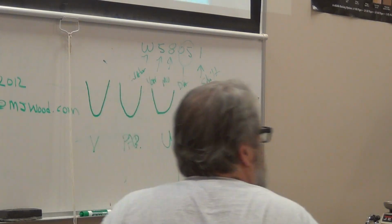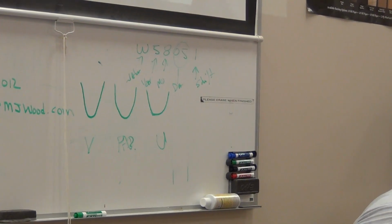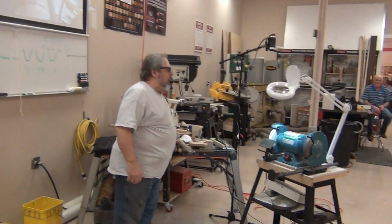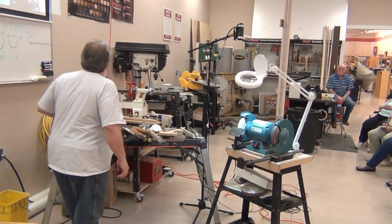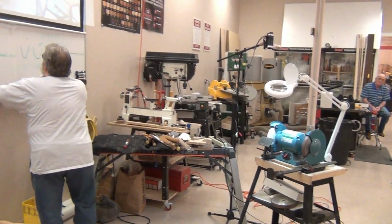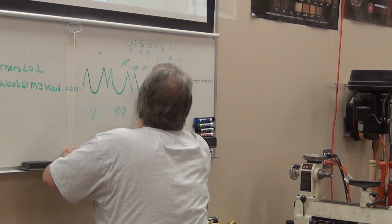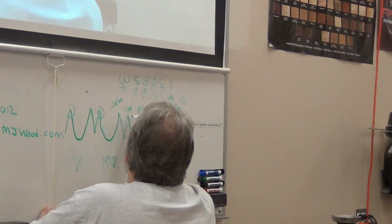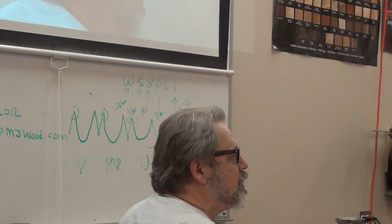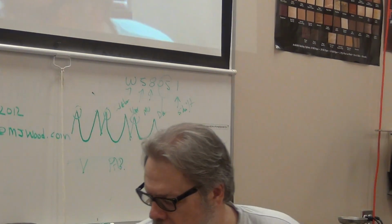And different manufacturers make them different. And in the case of Thompson, he makes a couple of different ones, all right? And the thing about them is the way you sharpen these changes the relationship to these edges, the geometry here. Even if you sharpen them all the same, this relationship to this is all different depending on which kind of flute geometry you have. And these are Daniel's. I'll send these around.